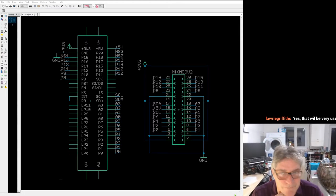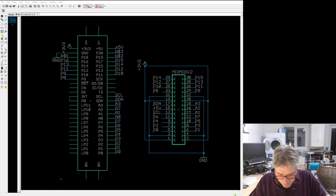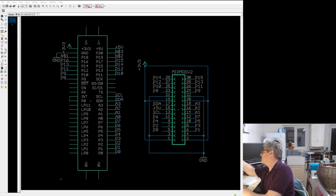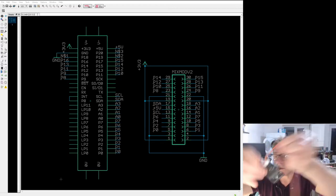So yeah, having a little Mixmod adapter. It's slightly compromised because it doesn't have all the ADCs. It only has 3 ADCs rather than the 5. And then I use I2C pins where the other 2 ADCs were. So that just fits on the slot and has a socket pointing out, and you can actually sit a PMOD like so. You could put one of these in, for example, or you could put the tester in,